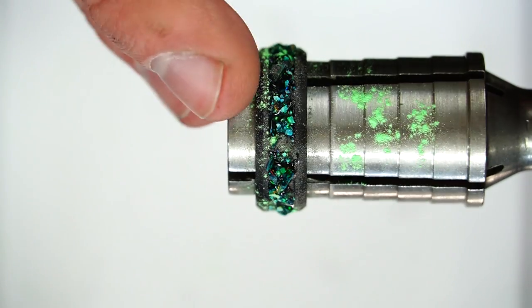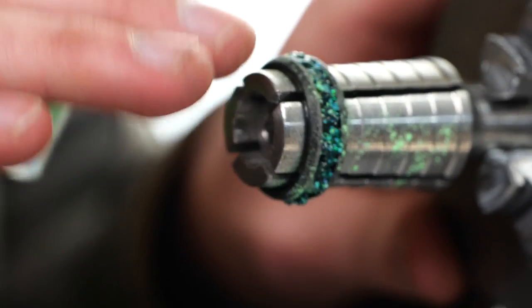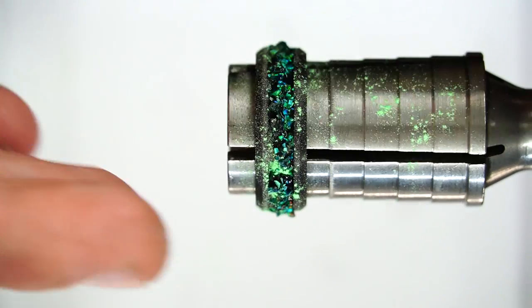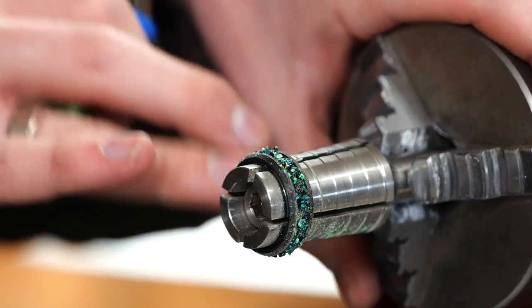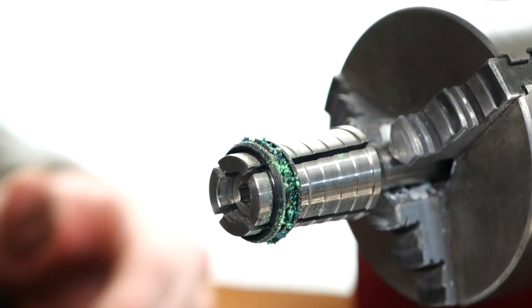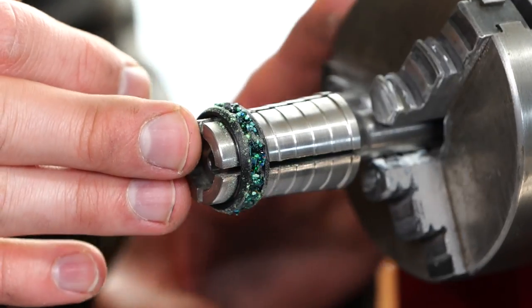So what you traditionally do from here is you just repeat the process until you build up layers high enough to cover the edge of the carbon fiber. Then you grind it all down and just sand and polish it up and you should be good to go. The reason you have to do that, you're kind of covering yourself up every time you go, and you guys might be thinking that's a little bit redundant. Like, if you're just gonna cover up your work, why are you bothering?